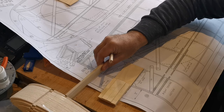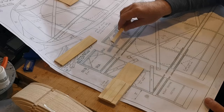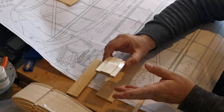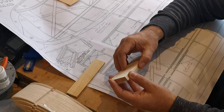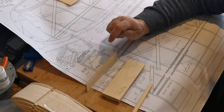There's a spar made out of plywood that slots into a box here, and at the rear the same thing — with this spar. So there'll be two spars made out of plywood on one wing panel and one tongue on the other panel. The first thing I'm going to do before I actually start the wing is to make this box up and make sure it's a snug fit for the tongue to slide into, rounding the edges so it's nice and neat, as that will determine how snugly the wings come together.